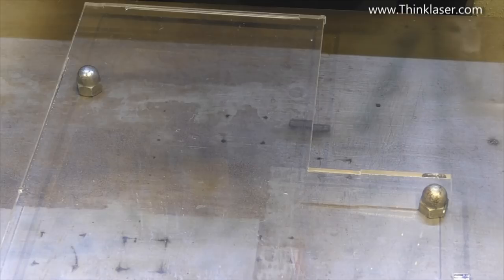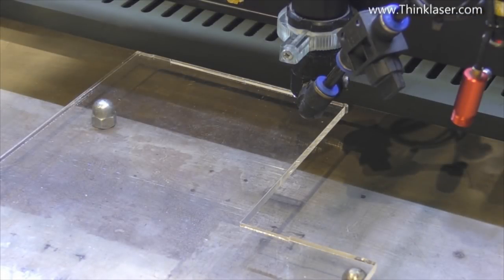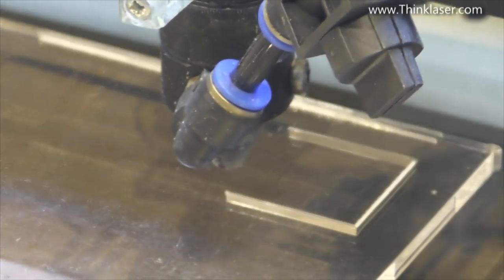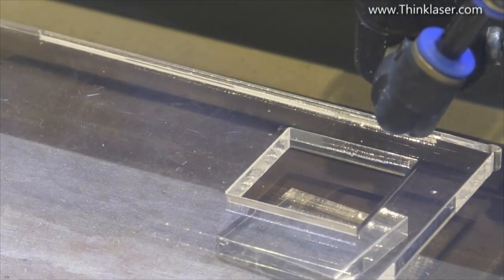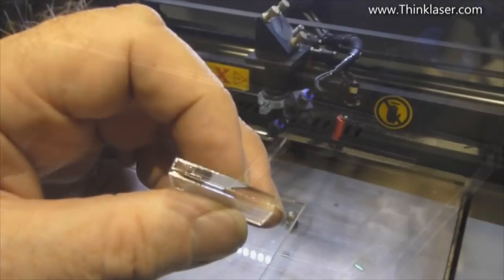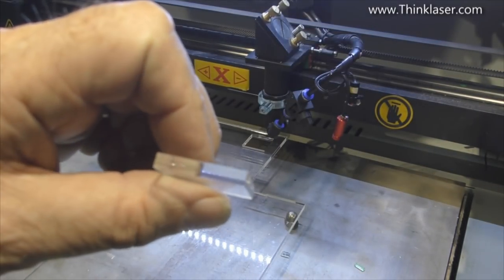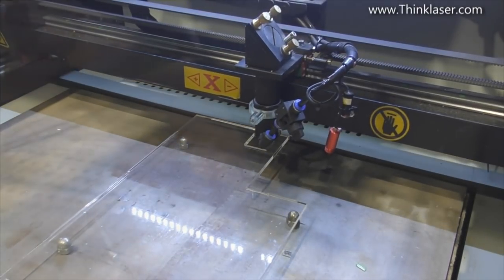There's nothing you can do about it - it will cut with striations because of the stepper motor, and those striations will be mixed in with the natural striations from the previous part of the video. We'll use 5mm for our testing as a fairly middle-of-the-road thickness. There are two types of acrylic: cast and extruded. There is a big difference between the cutting and engraving performance of these two materials. The first cut with air assist has not much beam drag, it's fairly vertical, and it should drop out because the smoke is going down below.